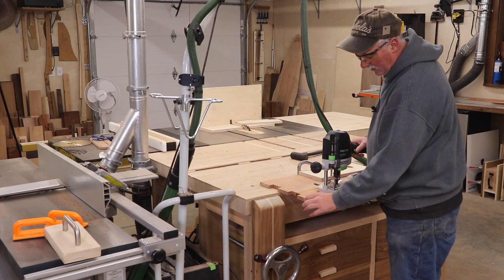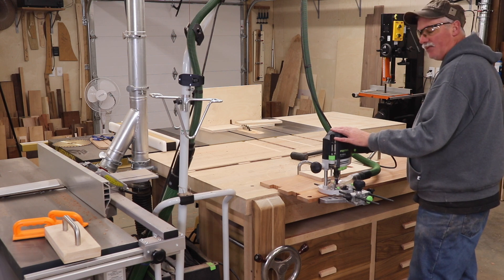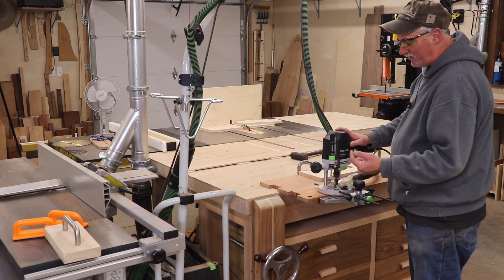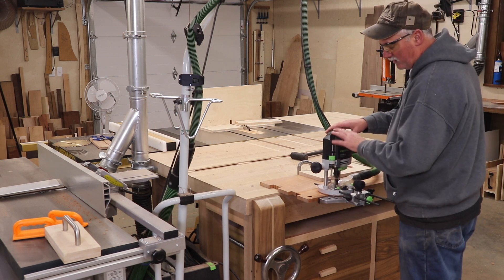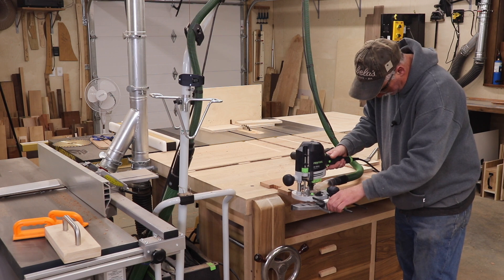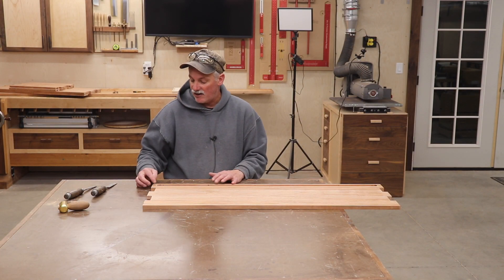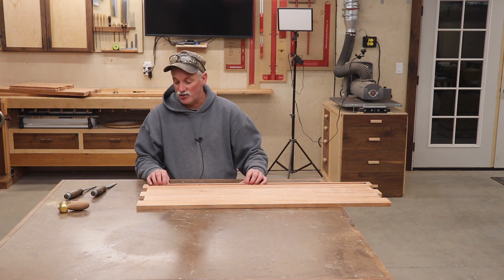For the grooves in the bottom, I'm coming in about an inch, and I went ahead and plunged this ahead of time so I have natural stop and start points, which frankly just makes it easier with this router — because with the dust collection on it, it just gets hard to see. I am going to do this in two passes. The side panels just go all the way through, so those aren't a big deal, but the long panels have a start and stop point on them. I'm just going to spend the rest of the evening squaring up these ends and the stopped dados for the bottom shelf, and be ready to get my measurements for that bottom shelf in the morning.